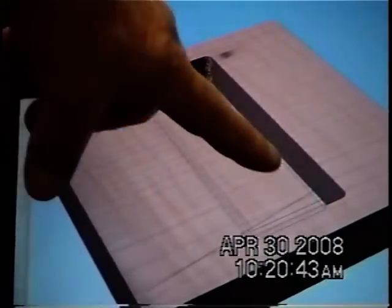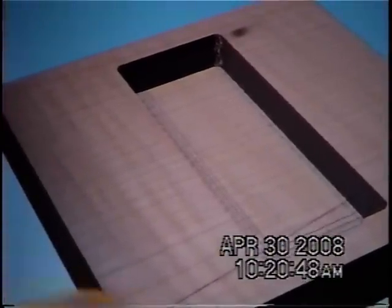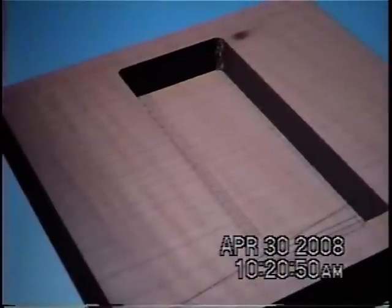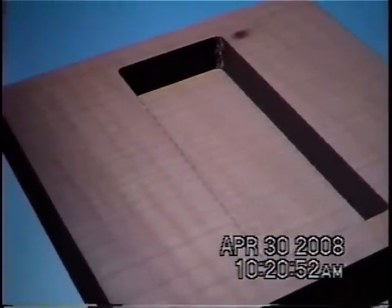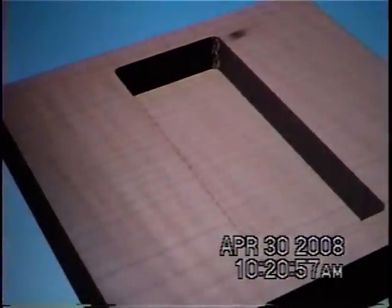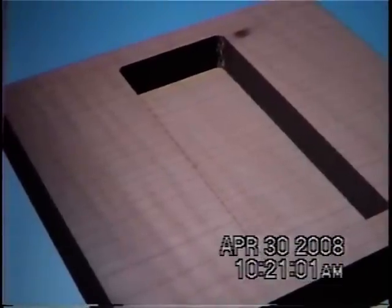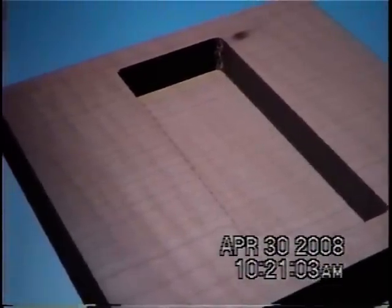It's set off on the inside of this thing, but this is going to put the profile, because I have to offset it to start with. And I tell this to preview this toolpath. It doesn't hardly show me anything. If I offset it again, further out to the side, it will show up, because I'm cheating the machine.